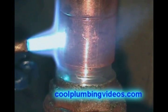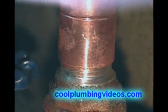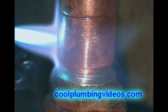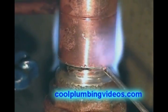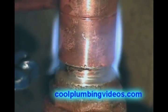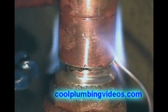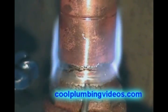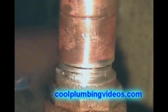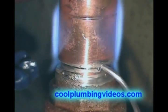This is a vertical solder, and once we get the solder to start to take, we'll start wiping the solder up into the joint rather than wiping it away. Now it's sucking the solder up in there, and once we get a good flow, notice that we gradually pull the fire away from the fitting so we don't overheat it and have solder running everywhere. We wipe it up in there with the glove or rag, and then we'll cap it off with a little extra precaution.